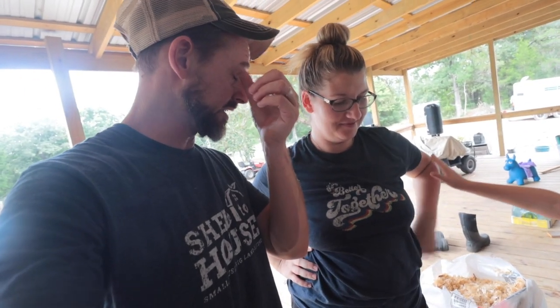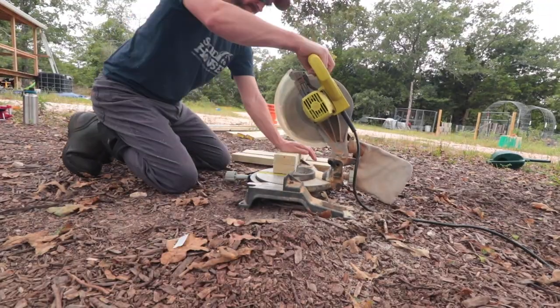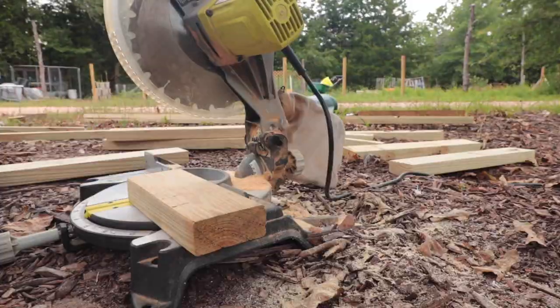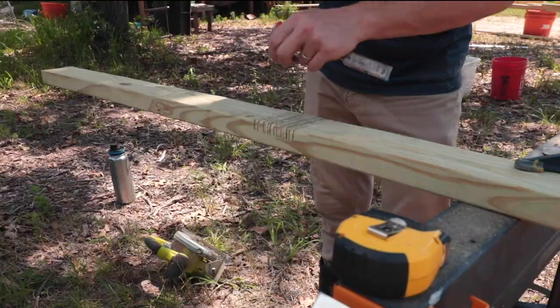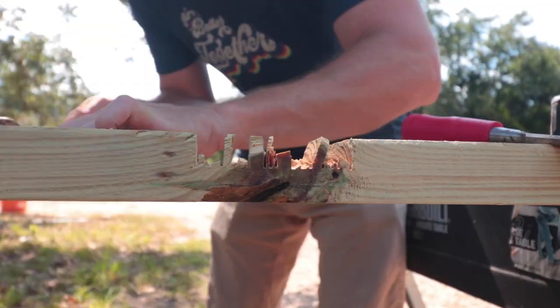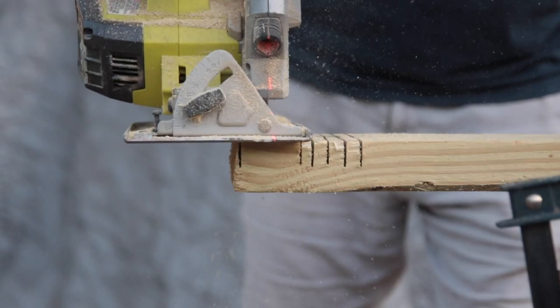We still need to build the tractor. Following John's book, the assembly for the chicken tractor was actually very, very easy. He does a great job laying everything out in the book, so it was a piece of cake. We chose to go with the half-lap design for the extra strength, plus by doing the half-lap it takes out a little bit of weight on the frame. I had a weak circular saw with smaller batteries — it was just outmatched. I highly recommend that you use a corded circular saw for this. It'll just make life a lot easier.